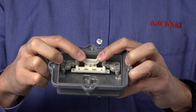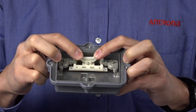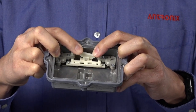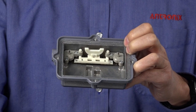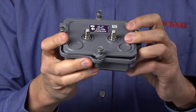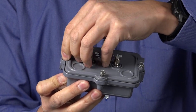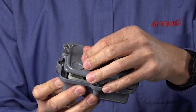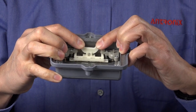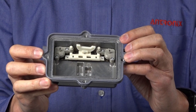This unique U-shaped rocker mechanism inside the bypass allows the faceplate to be removed and installed at an angle while the bypass can move up vertically. As you can see, as I'm pressing down on this, no matter what angle I'm pressing, the bypass goes up and down vertically. So if an installer is installing the tap and removing or installing the faceplate at an angle, and pulling on the side bolt as opposed to the proper center bolt, the faceplate can compress against this U-shaped rocker mechanism and enable the bypass to go up and down vertically to ensure a make-before-break for non-interruption of AC and RF power downstream.